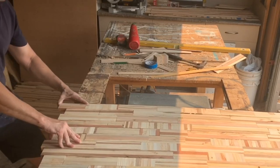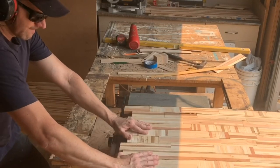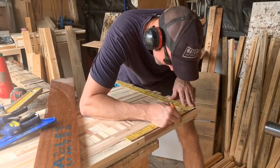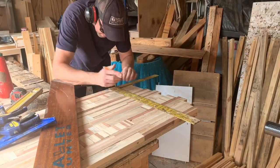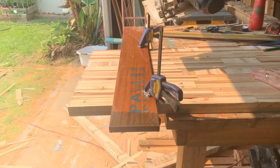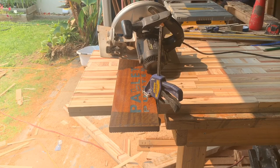Given this one's a desktop it's pretty important to get it flat. I've got one straight edge on the desktop already so I'll always use the table saw because I know I'm going to get a nice parallel cut every time. For the two ends of the table, ideally a track saw would be awesome, but I don't have one — so I just clamp on a few bits of timber, grab the circular saw, and whip those ends off. Perfect.